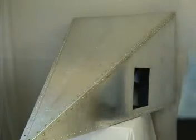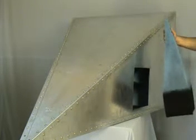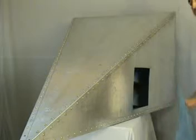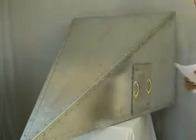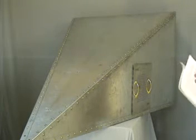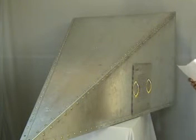You can see the kind of termination used inside — there are tens of these terminations at the back, providing a very low VSWR load to the GTEM cell. As options, we can provide forced ventilation inside the chamber, feed-through connections of microwave or fiber optic, illumination inside the chamber, and an XYZ positioning device for testing the equipment under test.